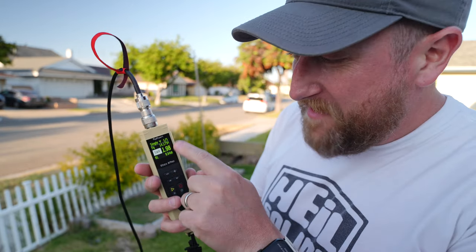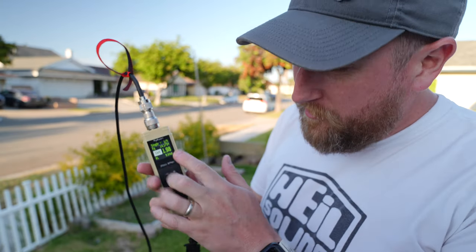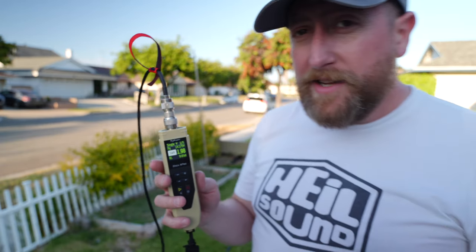Note: while you're adjusting the coil, you're going to both feel and hear a click. That's the outer tube riding up all the separate coils. The coil is just an unbroken wire that's been coiled up. As those metal fingers on the outer tube ride up the different coil segments, you're going to hear and feel clicks. The basic tuning understanding is: once you get the gross adjustment of 3.3 centimeters, you use the SWR meter to give you a reading. Let's check it — we're a little bit high, north of 2-to-1 SWR. The tuning instructions basically say take it to less than 2-to-1 SWR and stop.